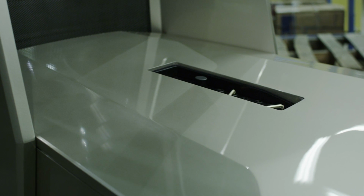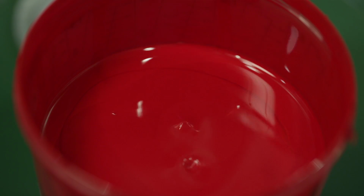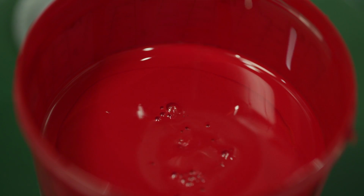One has to be very cognizant of the feed and speed of the cutters, as it's very difficult on both the equipment and the cutters themselves. We had to learn exactly what speeds we're going to work out in order to give us the best finish to allow the automotive paint quality to show through.